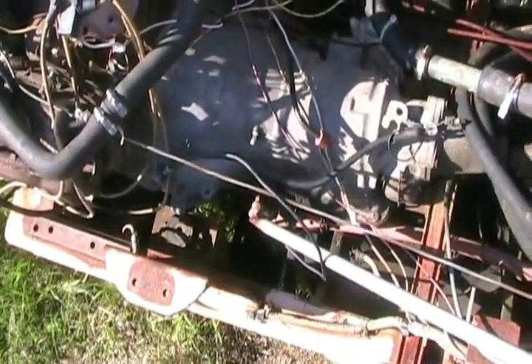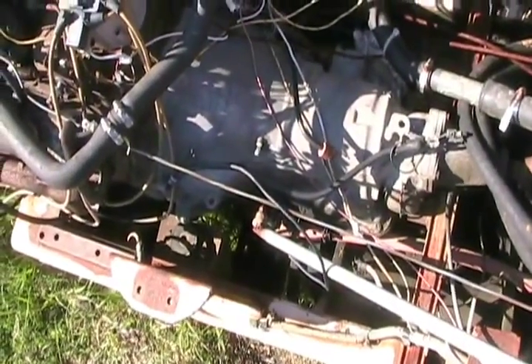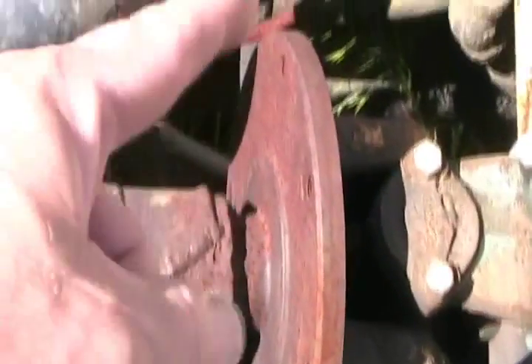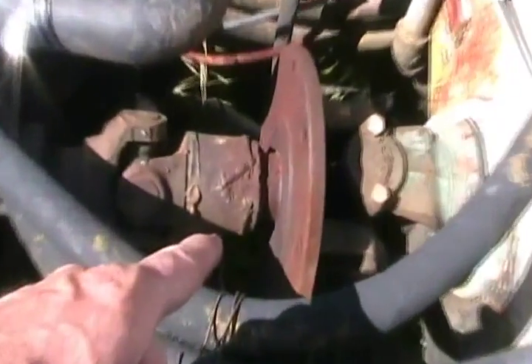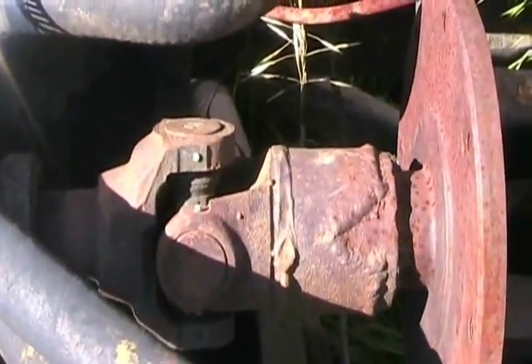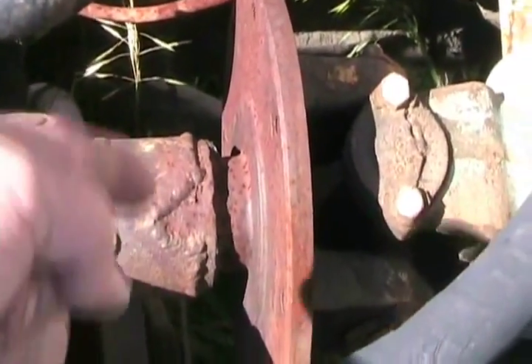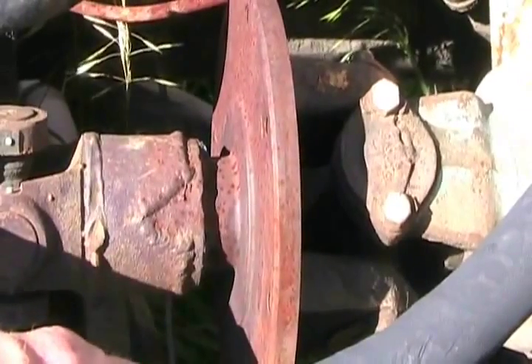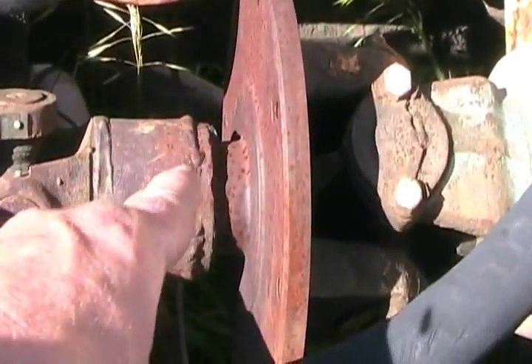Looking at the side of the machine, there's a lever with a long handle bar. It goes down and it shifts the transmission from neutral to drive, two, and one. I left out park and reverse because that would spin my great big hydraulic pump the wrong way. The original system had that big U-joint on it, and this drive plate bolted to the flywheel of the old diesel engine. So what I did was just took the yoke and everything off the Chevy engine — still original — and cut the drive shaft really short.